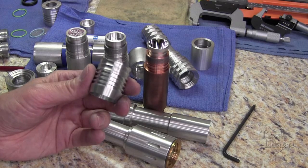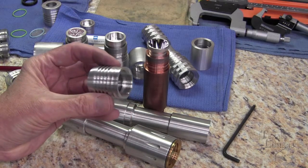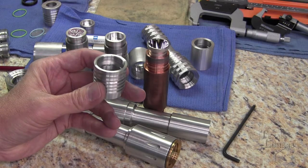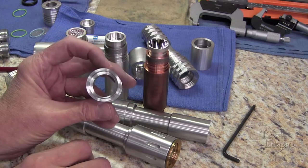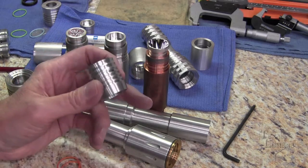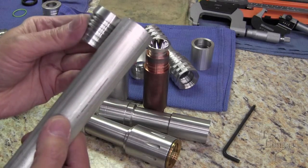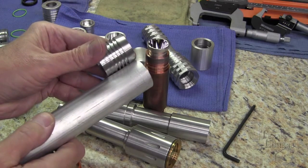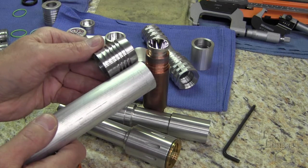This is a head we just made over 500 of for a customer's light order — we'll be machining this for you a little later in the video. Every single part requires OD machining, or as I say for this design, OD sculpting, ID boring, relief cuts, and threading. We'll be machining this head out of raw stock just as I'm showing it here. The body end machines first so that we can later use a mandrel to hold the part while machining the bezel end.